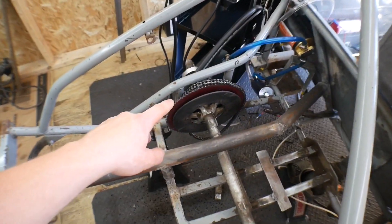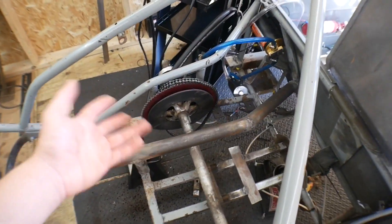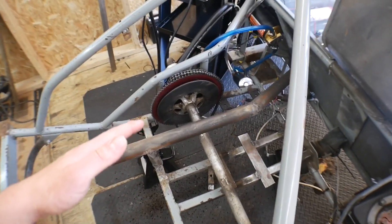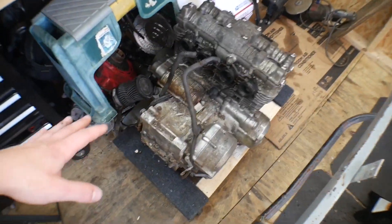We're not going to be using this sprocket because it's too small and it was meant for that engine which is all tucked away back there. It's like normal go-kart, minibike chain, which will not be able to handle the power of this — it would just snap probably on impact. But it's going to be the same design; I'm going to try and find a split sprocket for it and use that area as somewhat of a template to figure out our whole sprocket system.